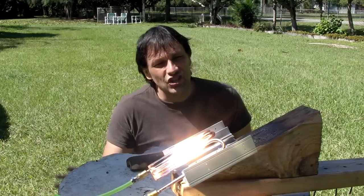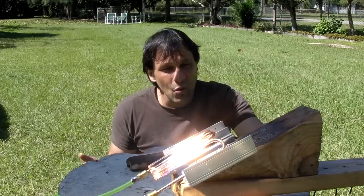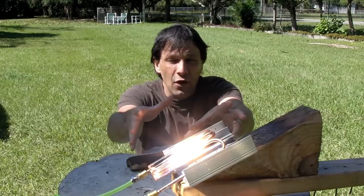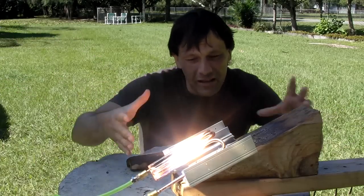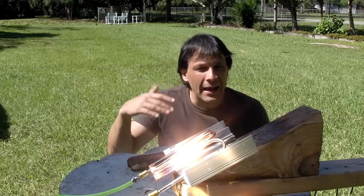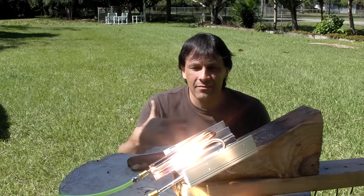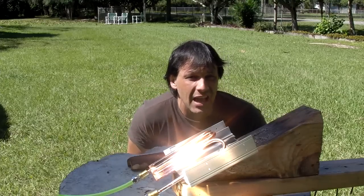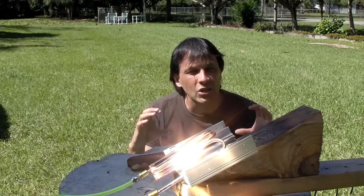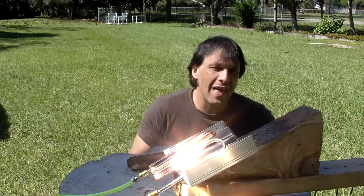There are other applications for a Fresnel lens that can be done like this. This unit could be used to make flash steam if your water temperature coming in was hot enough — we're going to cover that in other videos. If you do want to heat water in a swimming pool or a water tank with a Fresnel lens, this is the way to do it — at a fixed focal point, tracking throughout the day, with the spot a little wider than the optimal focal point. Someone has done a video where they took Pyrex, painted it black, put oil inside, and put a copper heat exchanger in there — basically getting the same result, but that design is actually more efficient because the oil gets hot and heats the water all the way around, and it also acts as an insulating barrier.